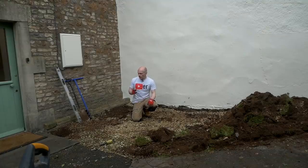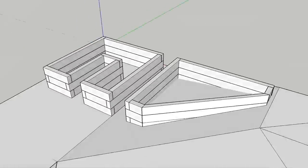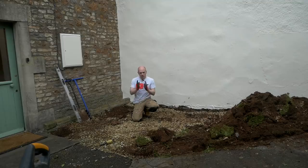A bit of explanation for the corner posts: because we're using the oak on its shortest side - they're 100 by 200, or 4 by 8 - using it on that narrower side gives us more height to the bed with less timber, but they need a little bit of stability.